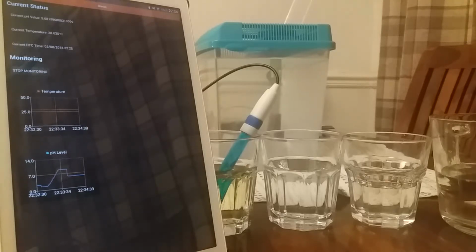However, due to the method used to calibrate the device and the fact that I don't have access to any liquids of very specific pH, or potentially more accurate devices to measure pH with, I'm unable to calibrate this device to be fully accurate at this time. But all calibration is performed in the client software, which converts the raw data sent from the main board. This will make it easy to calibrate in the future without having to modify the hardware or firmware in any way.